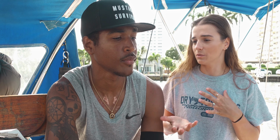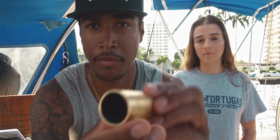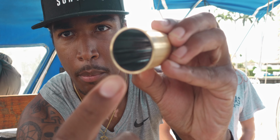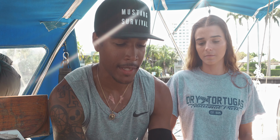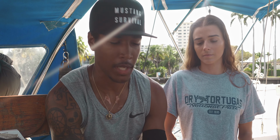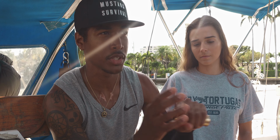And I don't know, why did we decide? So the cutlass bearing is this piece here. This goes inside the strut. And if you guys look closely, you can see the metal outside and there's a rubber inside, which is the bearing part. In order to get that out, you have to have this precise measurement to push the metal. You don't want to just push the rubber, or you don't want to push the strut, because you don't want to put force on the strut unnecessarily.